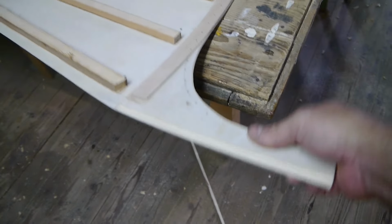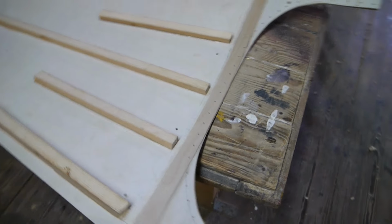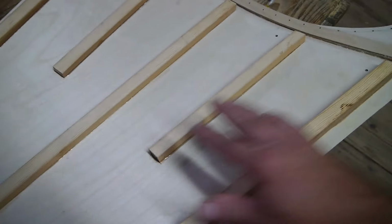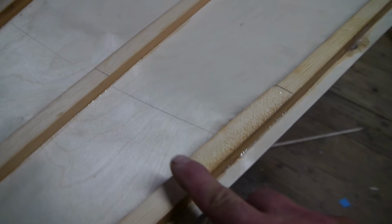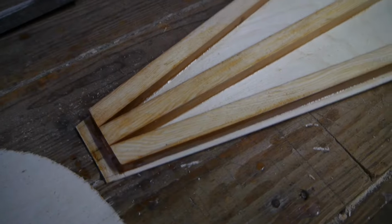It's all massively doubled at the front. These short stringers here serve to prevent the thin plywood from giving way and collapsing if someone sits on the back of the fuselage when boarding. Here we have the bearing surfaces for the clamps that attach the whole thing to the transverse frame of the fuselage. And here at the back is the end. That's where the whole thing ends. Looking nice, don't they?